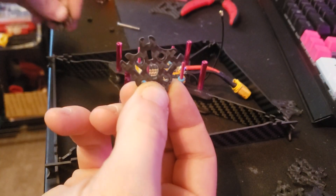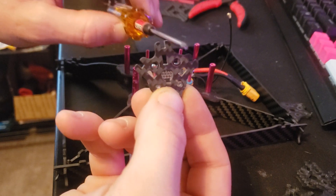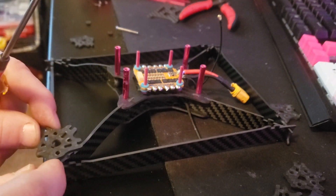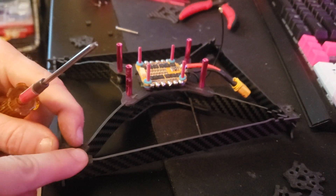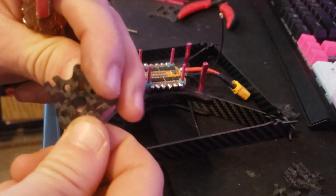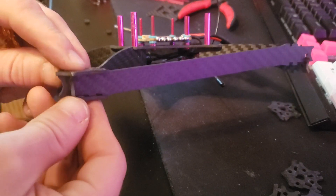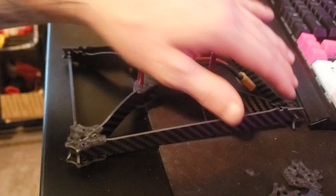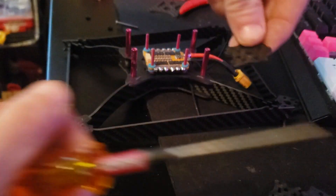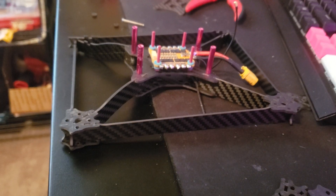Psych — we're not done yet. If you look at the motor plate, see this part here and this part here — this one's smaller, this one's wider. The smaller side always faces in towards the center. So for the front motor plate, the smaller side goes on the inside and it goes on the bottom. Same for the back one — smaller side faces inward. Let's do that for all four.